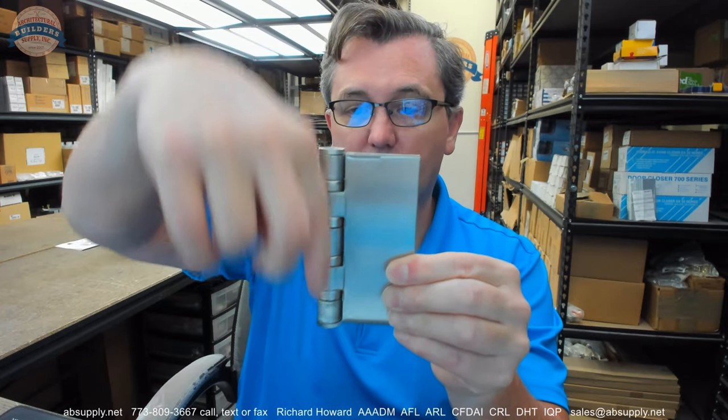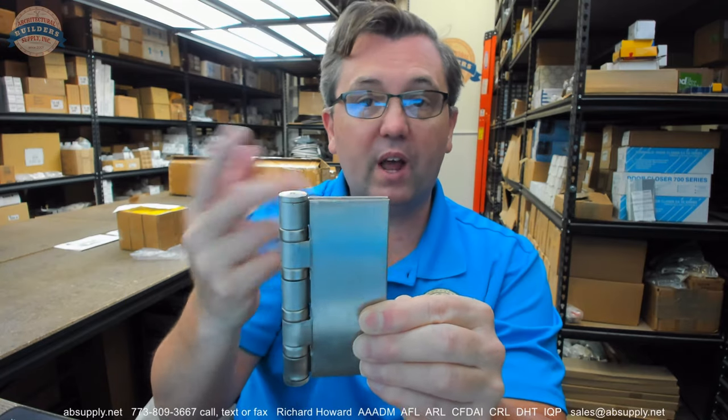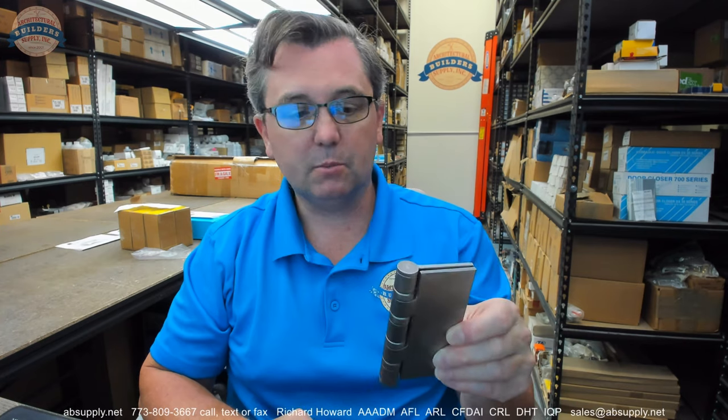It may not be the best option because I haven't seen a cross section of the gate — how thick is the gate, where is the vertical axis of pivoting in relationship to the center of the thickness? They might be better served by having a 4.5 by 4 or maybe a 4.5 by 5. You want that projecting hardware tucked back as close to the face of the door and frame as possible. A 4.5 by 4.5 is used everywhere, but that does not mean it's the best size. I've heard it said by a representative of a hinge manufacturer that they only make 4.5 by 4.5 because all the distributors demand it, when 4.5 by 4 might be a better option. In any instance where you have a frame that wraps the wall with no projecting trim, a 4.5 by 4.5 is not the best hinge — a 4.5 by 4 would be the proper best-practice option.